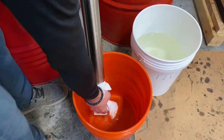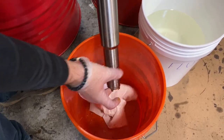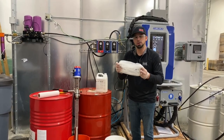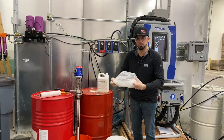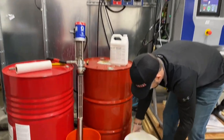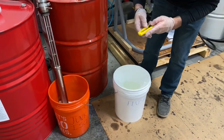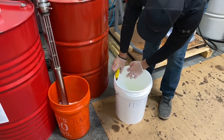Push down on this valve in the bottom — there's a foot valve in here, which is a check ball. I like to push into that check ball and get all the residual material out of this stick pump as best as I possibly can. Before I put the stick pump into my flush bucket, I want to get one of these strainers. This is a perfect size — it snaps on, it's got an elastic band, it snaps on the five-gallon bucket. You can get one of these at any box store for a couple of bucks. Snap this onto the bucket, get the elastic on there, take some of the slack down the side so you don't have too much slack going down into your flush. I also take a knife and put a small hole in the backside of this for my transfer pump to slide in so I can still use the elastic.